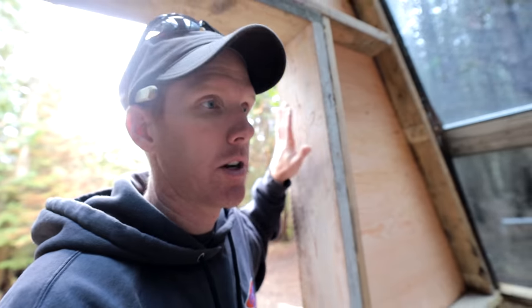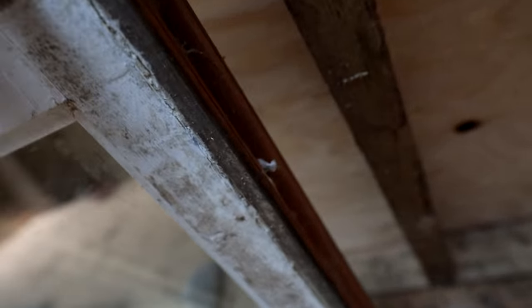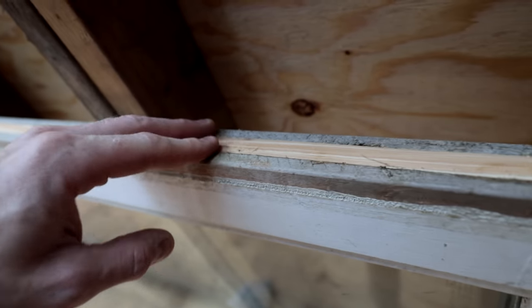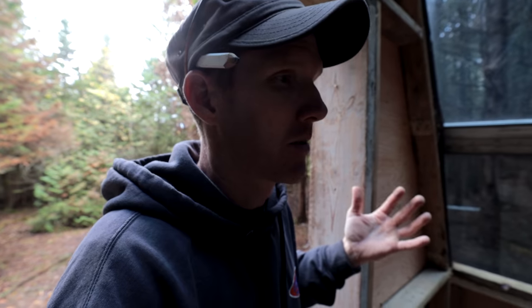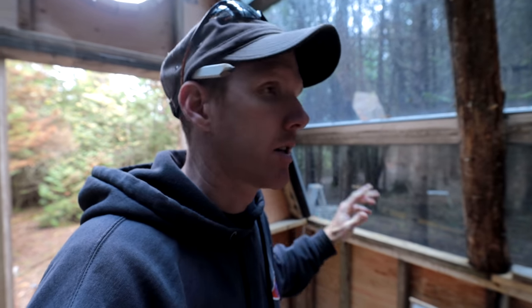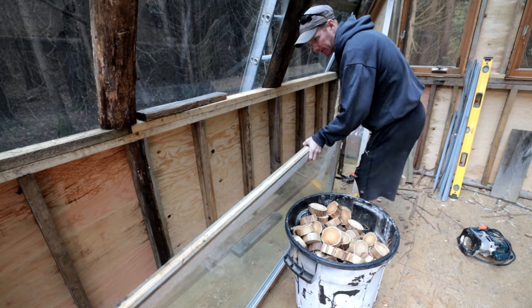I've got an old salvaged sliding patio door. I ended up gluing a little strip into the groove on the side where the hinges go — used PL Premium to hold it in and it's hardened up. That's where I'm going to mortise my hinge and then hang it on the door jam. I'm not exactly certain the door will hold up long-term since it's not designed to be hung from hinges, so I'm putting three hinges on for extra support. If it fails in the future I'll just build another door, but I really want to try this and see if it works — it's just a big chunk of glass with a couple wood sides.